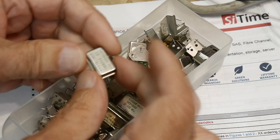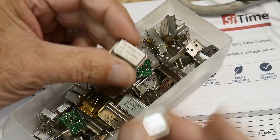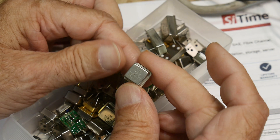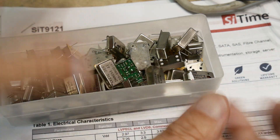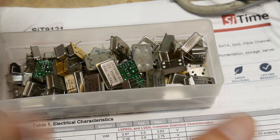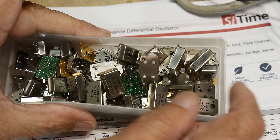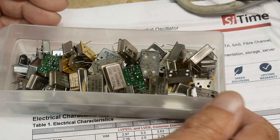You've used them before. You can get them in the main package — 14-pins — or these little 8-pin things with only four pins on them but fitting in an 8-pin package. These are made with quartz crystals. The quartz oscillates at particular frequencies, but crystals kind of stop working around 40–60 megahertz and just don't like to go above that. You can run harmonics, maybe getting crystals that'll run harmonics higher than that.